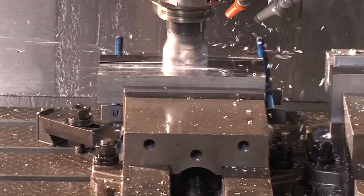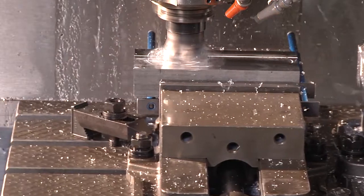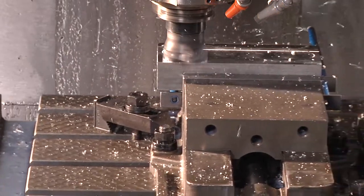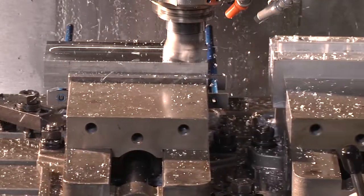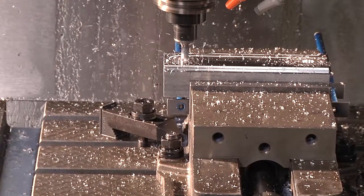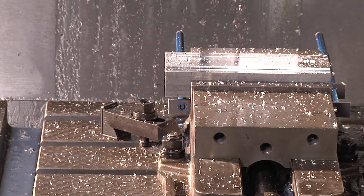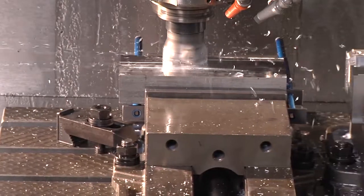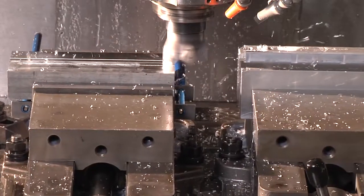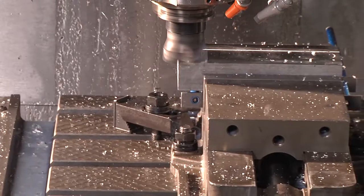All you have to do is perform a minimum cleanup on this surface. This is why we created a dovetail with extra depth — so we have enough material to simply re-cut the surface. We will also re-cut new locating holes to ensure we locate the part properly in relation to our re-qualified surface. When we initially put in our locating holes and prepped the part for our Technogrip, we left enough room to re-establish new locating holes when we re-cut the dovetail surface.